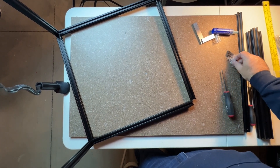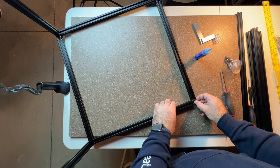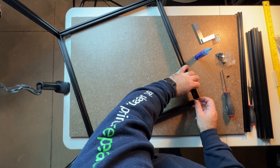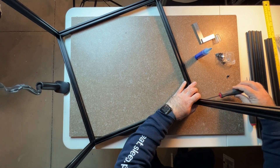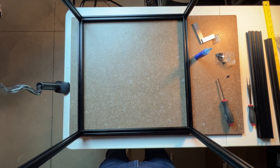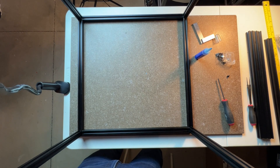Now I'm down to the very last corner — pretty much the same process. We're just going to put both screws into the ends of the extrusions and slide them in a little bit closer. Make sure you grab the right extrusion — you want the ones with the holes. Drop this piece right in. You can tap all four of the tops of these legs, and if you have any bounciness that means you're not quite square, so you need to drop either one of these pieces or the top piece. If there's no bounce, you're good.